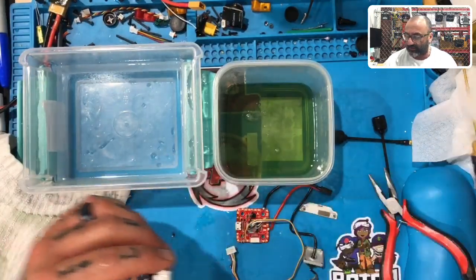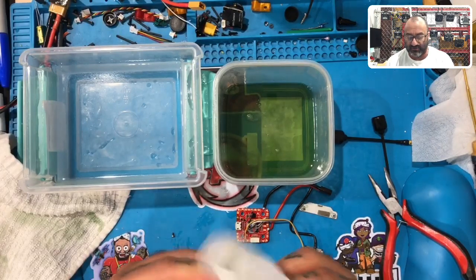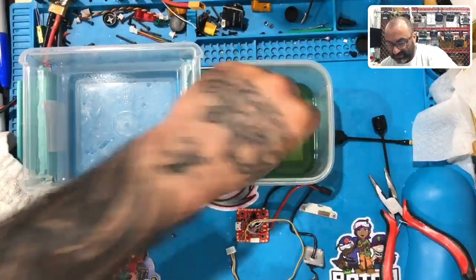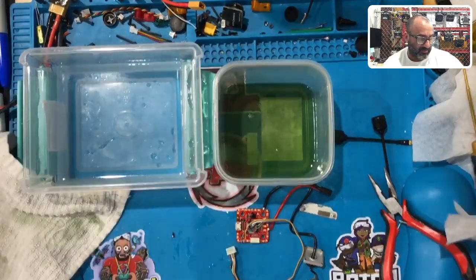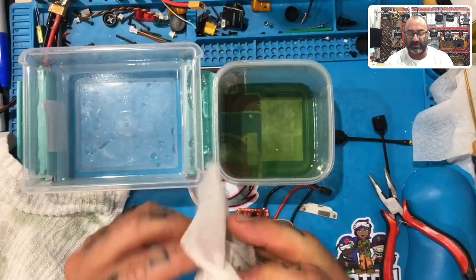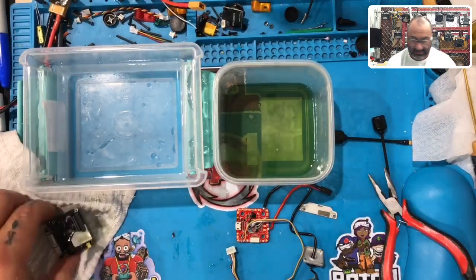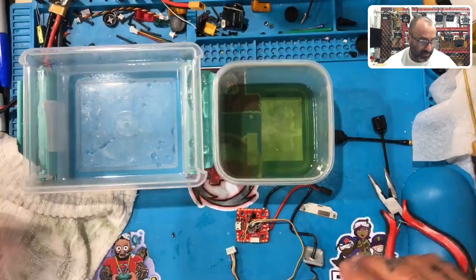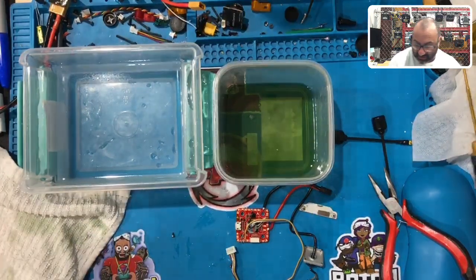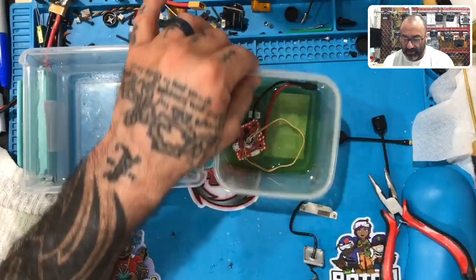For the camera, there's really not much you can do. Just take the back of it and dip it — like that. Pat it as dry as you can. What you don't want is for it to get into the front of the camera where the lens is — if it does, you have to take everything apart and dry it off. Just pat it off; don't wipe it. Place everything on a towel to let it dry — it'll take a couple of days to truly dry.